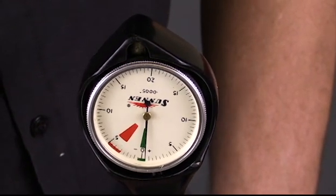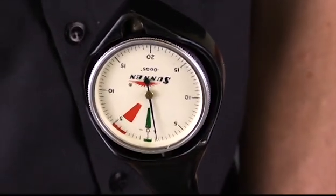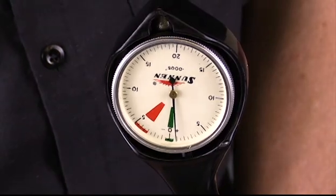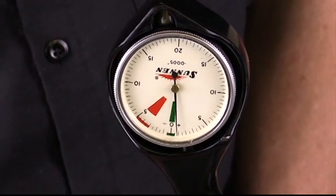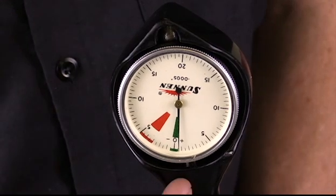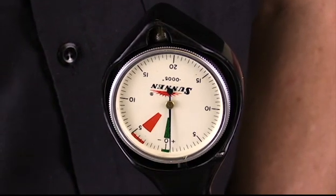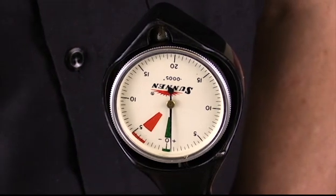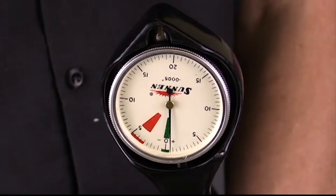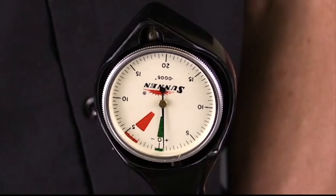To read taper, I need to come farther up the cylinder — much closer to top dead center — maintaining the same measurement direction and rocking back and forth. At top dead center, I rock it and find the clockwise stop point — it's exactly the same. I'm plus five ten-thousandths from bottom dead center to top dead center, so I've identified there is no taper in this cylinder. There will be a specification for taper; you just have to look at your engine-specific service information to determine that.